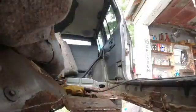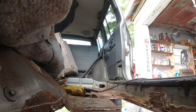Over up in here, see that? Yeah. And I can get that out without getting into those lines, but we're going to have to remember when we put the new piece in not to weld in that area. I think it would do well to cut out that little hole. And what I'll do is I'll cut it here and here. That way you'll see new floor pans all the way up here. And these over here are good, so we'll leave that part in.